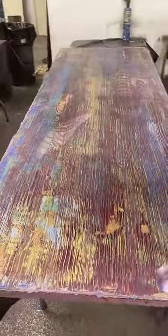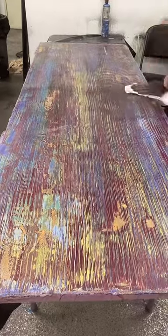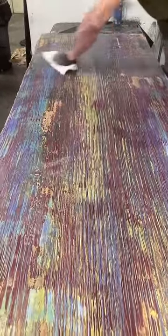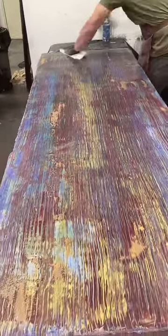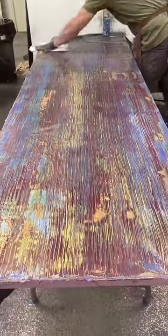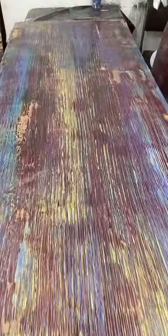This is our countertop epoxy wall epoxy that now we're just polishing out. I troweled it down with a red base coat and then I sprayed a lot of accents into the top of this. And kind of scraped them with a V-notch trowel to create a wood graining effect. And instead of just pouring a clear of our countertop product to get it all shiny over the top, what I'd rather do is just really polish this because you can get a really nice, almost petrified wood look out of this. So I think this will probably be preferred to actually polish when you can.